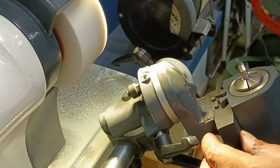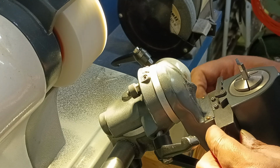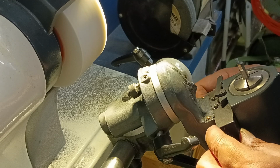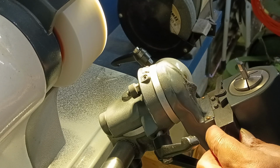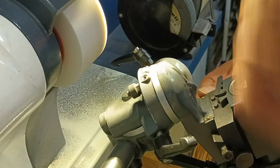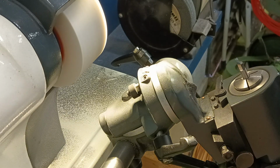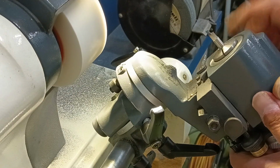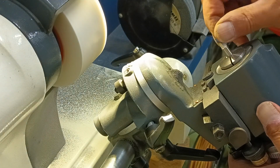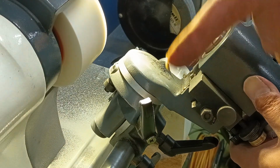We'll undo our lock. We're looking for 1.5. Right, that's offset by 1.5. And this little facet here is basically 60 degrees between each facet, but it's 30 degrees from horizontal in that direction. So that's why we have this over at 30 degrees now. Of course, I've moved this over, so we have to reposition.